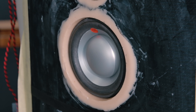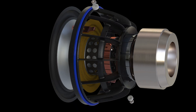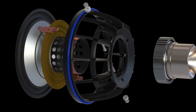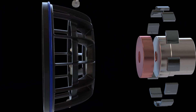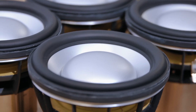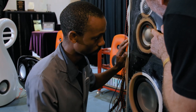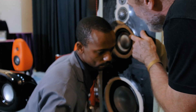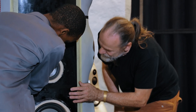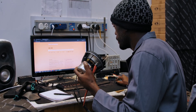Moving up we have a C100. The improvements we've brought to this driver for Moyer are a copper cap on the magnet pole that increases the high frequency range and reduces distortion tremendously. We've also paid attention to the breakup performance of this driver by putting carbon fibre rings at three strategic nodes: the neck joint, the dome joint, and the outer periphery — all of which help move those top end breakups to being well out of band.